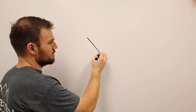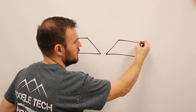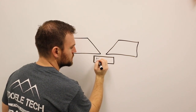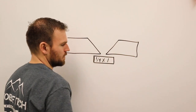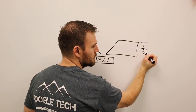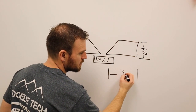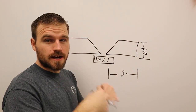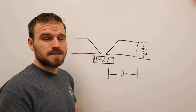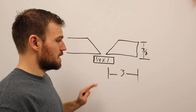So we're going to draw a V-groove. Our backing strip will be a quarter inch thick by one inch wide. The thickness of these plates is going to be three-eighths inch. We'll be running the plate — roughly three inches — then cutting it down and reusing that same piece of metal as many times as needed to practice. The extra plate length helps cool the weld down and makes it easier to weld.